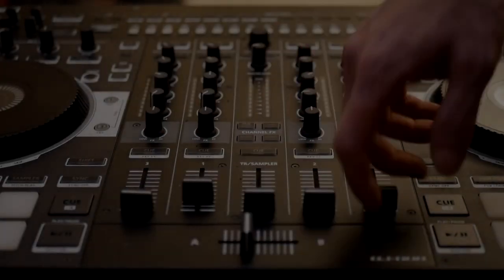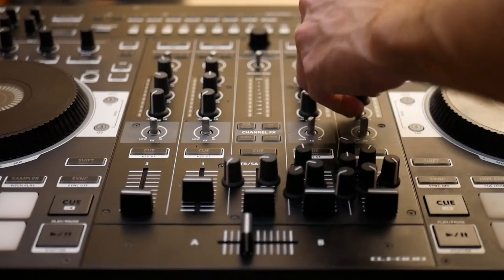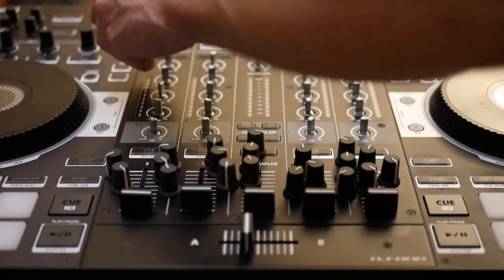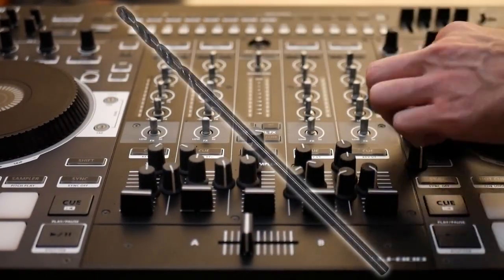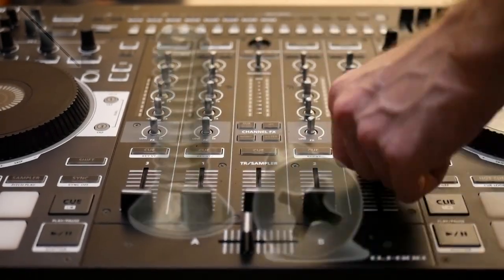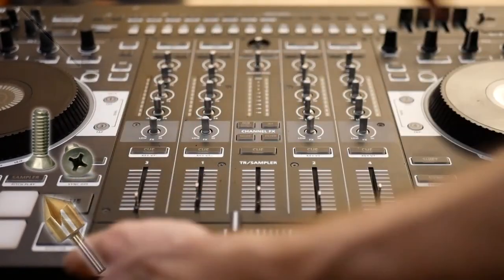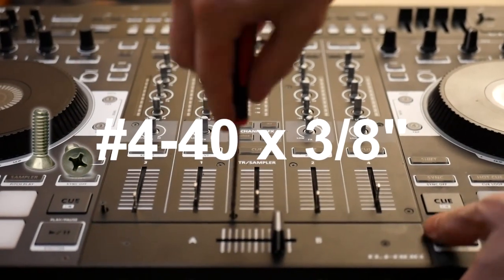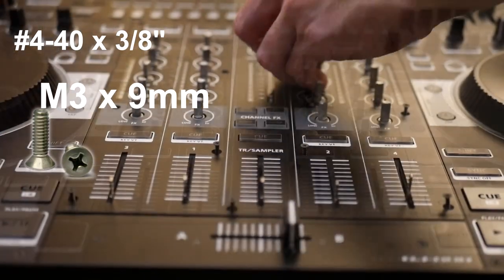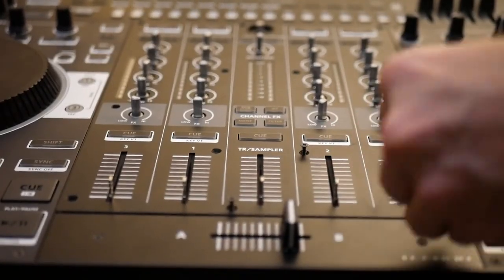Alright, let's get started. Remove all of the knob and fader caps and put them to the side. Once the caps have been removed, start removing all of the Phillips head screws from the faceplate section of the mixer. We're going to want a couple of tools on hand: first, a drill bit — I used a 3/32-inch drill bit, that's about 2.4 millimeters. You'll also need some flat head screws and a countersink. I used a 4-40 by 3/8-inch machine screw — in metric, that's an M3 by about 9 millimeters. You have a little fudge room; just make sure the threading is correct and you should be in good shape. You can always trim them down to size.